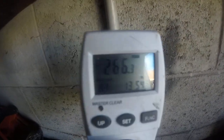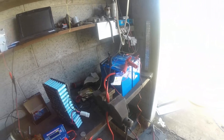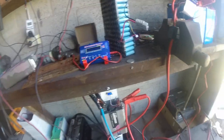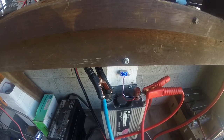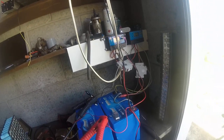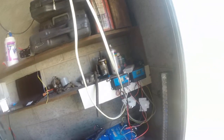Let's see how much load we're actually putting out — we're using 266 watts at the moment to run the battery chargers. With a 260-watt load we're still holding 12.8 volts right at the back of the inverter, no issues. And as soon as that load comes off, the voltage jumps straight back up again, so it's not really struggling at all.